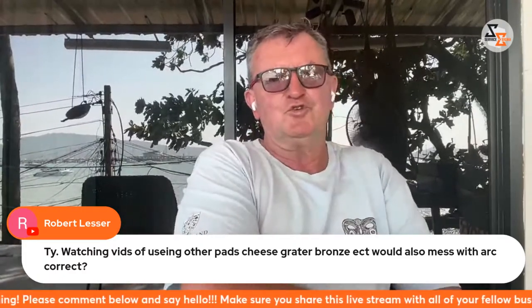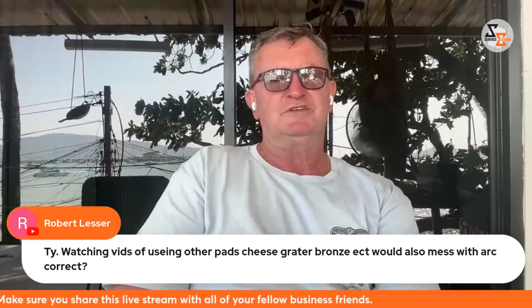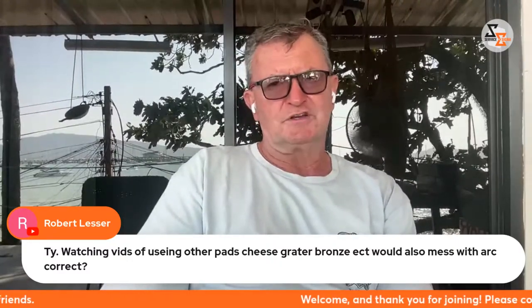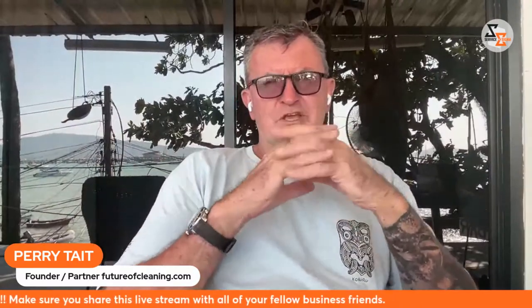This is Robert again. Thank you. Watching vids of using other pads, cheese grater, bronze, etc., would also mess with the ARC. Yes. From our perspective, you could only use magic eraser or silicone bristles with ARC. And if the debris on the glass is sand or grit, then you wouldn't use magic eraser because it'll get caught in the grit, right? So then you're down to just silicone. You don't want to be in a position where you've damaged the ARC coating. However, I think a lot of residential installations are not ARC.